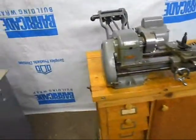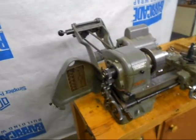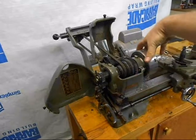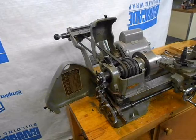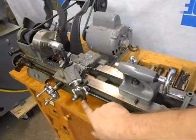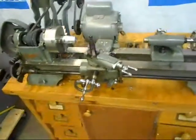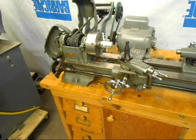The outboard gear train looks to be in terrific condition — I see no breaks on any of the gears. The original table is still here. All the back gearing and everything looks perfect on it — here's the bull gear, it looks great. As demonstrated, the traverse works, it's got a threading dial which is handy for threading — just disengaged from the lead screw at this point, but the threading dial is right there. So it's got pretty much everything that a lathe needs. It's a small one, but it works very, very well. This is Lucas signing off. Thank you.